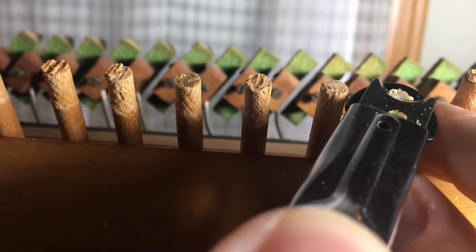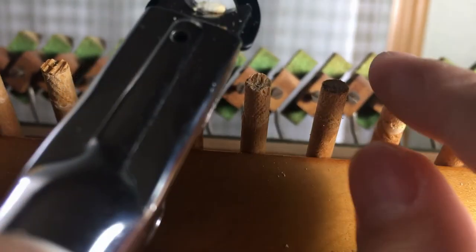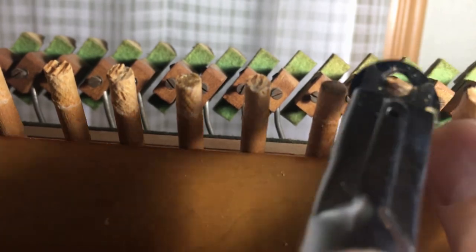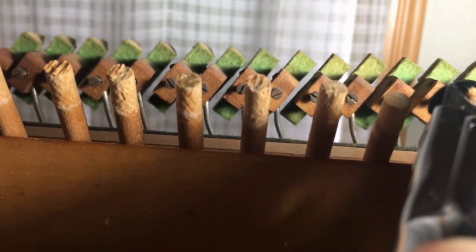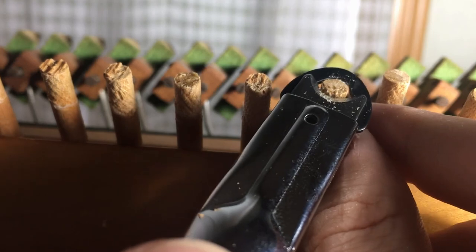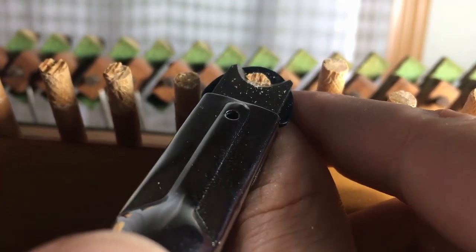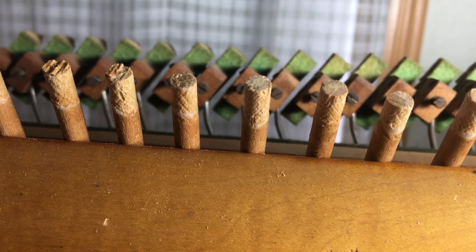I have a clean shank on top. Of course I'm going to measure the height and make sure all the new hammers line up and level perfectly. I can go over each one of these, eyeball it, and trim them just to make sure they are clean. Once I do this, I'll measure with the hammers and then proceed to glue in the new hammers.